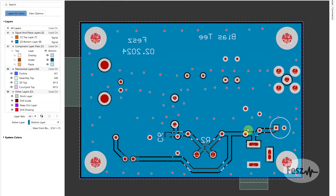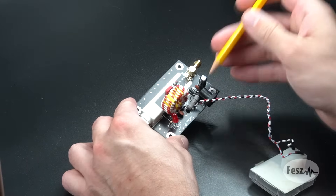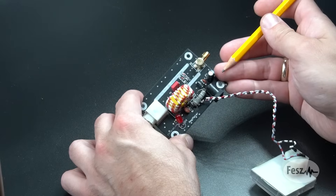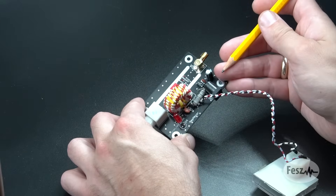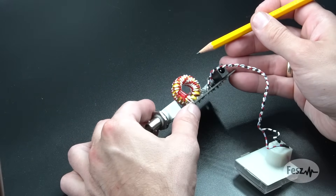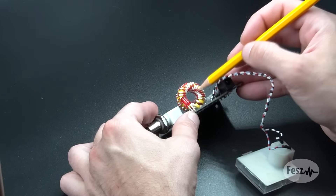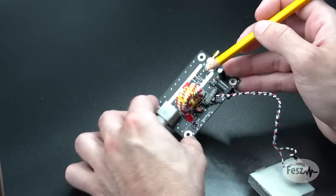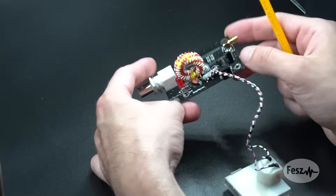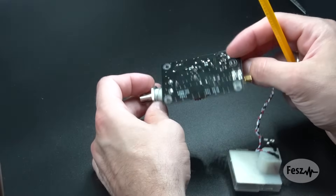Since this particular BIAS-T was not really intended for very high frequency — mainly the HF bands — this sort of placement should be just fine. For the assembly, I ended up using a large case-size resistor for the shunt, as the small component initially planned was burning out. For the large toroid inductor, I used some insulated wire in an attempt to reduce its self-capacitance. My idea was that this should keep the distance between the conductors a bit larger. I also added in a bit of hot glue just to keep things in place.